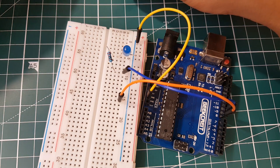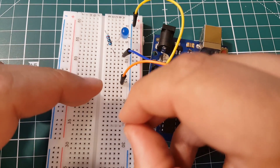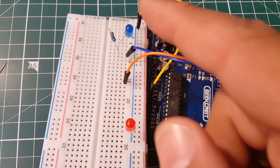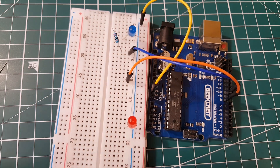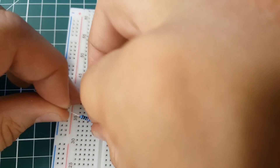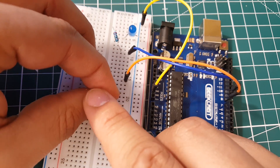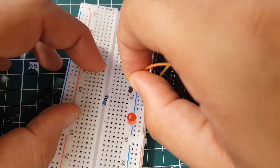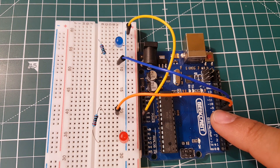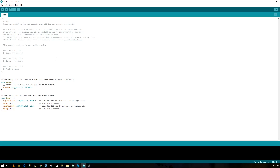Now let's set up a red LED for pin eight — the orange wire. We place the shorter ground pin into the ground rail, and stick the positive leg nearby. Then grab another resistor, connect one end to the positive side of the red LED and route the other end to the orange pin-eight wire. In theory we now have both circuits: pin eight won't fade, and pin nine will be able to fade in and out.